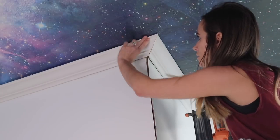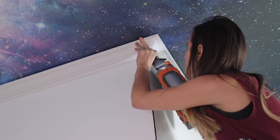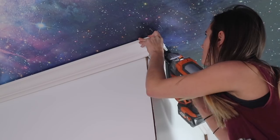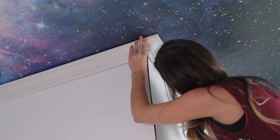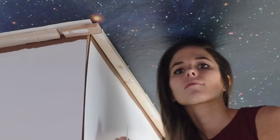But cutting a 45-degree miter will not match up perfectly if you're not bisecting a 90-degree corner. This results in a small gap where the molding meets, and I was okay with that in the inside corners because I could fill it with a tiny bit of caulk. But on outside corners, however, this is more visible.